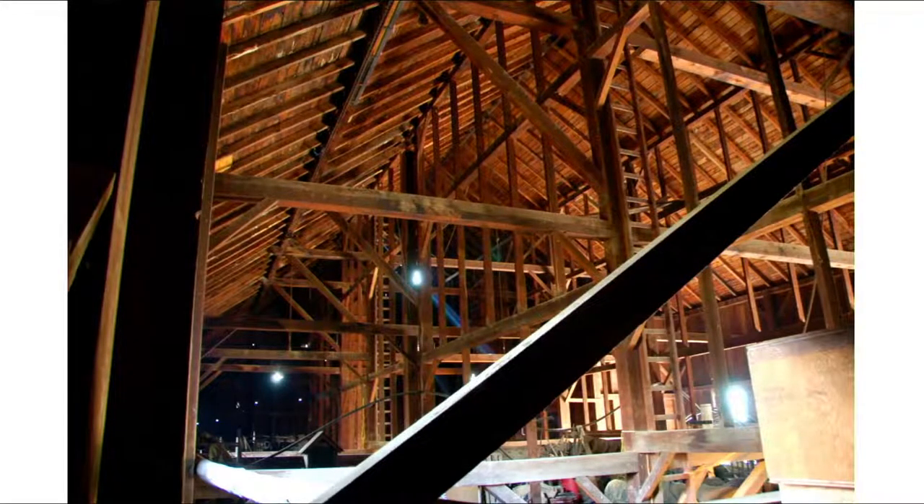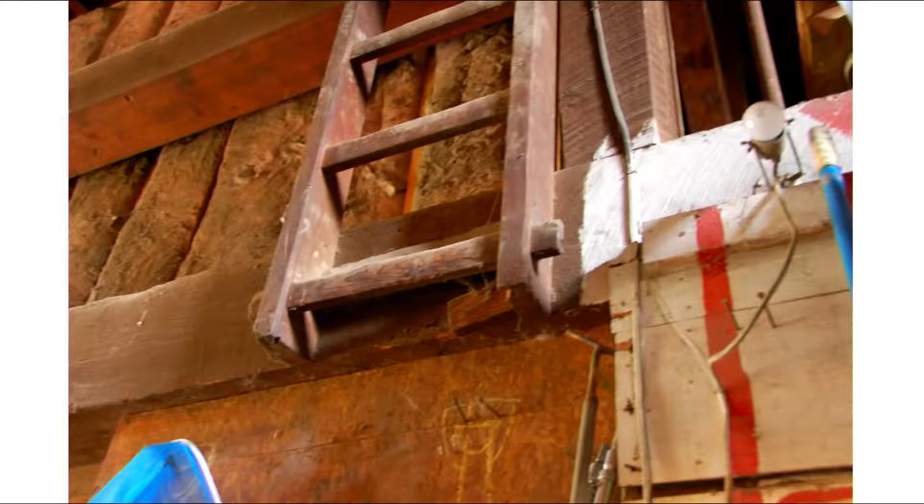It has your regular plate on the outside wall, an interior post with a plate on it, and then what's called a flying plate. There's another plate out here — a purlin plate. So there are literally four purlin plates and two regular plates on the outside wall, because the roof is so massive. I'm told the slate shingles on the roof weigh between 30 and 40 tons. Talking to members of the Timber Framers Guild, they said no one had a 60-foot-long circular saw — it was impossible. They said go down the length of that 60-foot tie beam and look very closely. You can see where the radius of the saw goes top right to lower left, then over here it's top left to lower right — right in here it changes direction. That ladder is approximately 40 feet from the front of the building. So they literally cut 40 feet into the timber, took it off the sawmill, turned it around and saw it from the opposite direction.